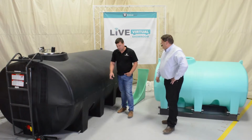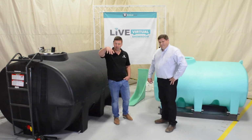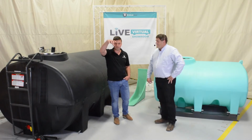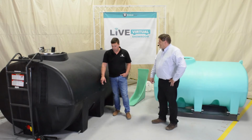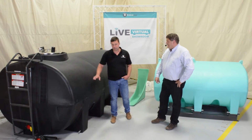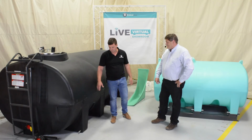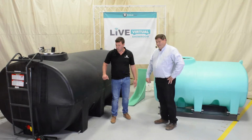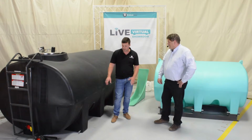The interesting part of it, like Doug said, is we had that tank hanging upside down, so we had the crane lift it up and then we dropped it, free-falled it a little bit, just to really test that pin and see if we could break the tank. We took the pins out when we were all done and got the tank empty. The pins were bent in a horseshoe from the strain of jerking that tank up and down. There were no cracks, no fatigue to the tank at all. Those pins held it absolutely solid.